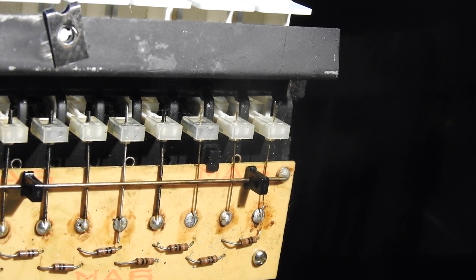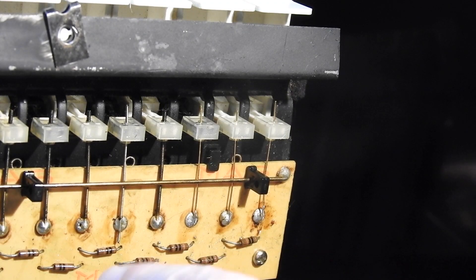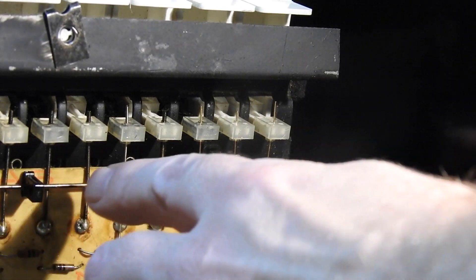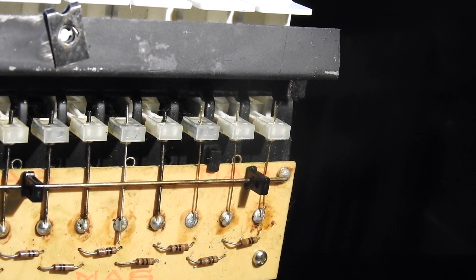After all that, looking back through the footage I just recorded, a couple of things came to light. I noticed another original J-wire that's just on the brink of breaking, so I'm going to replace that too. It was also very clear on camera that the bus bar was absolutely filthy. To make it a good test, I really need to get that bus bar off, clean it all off, and clean all the other contacts to give them a better starting position for the test.